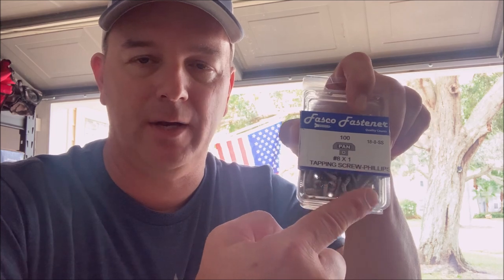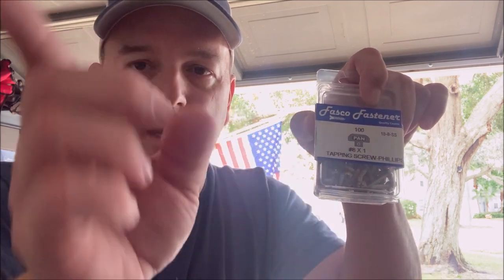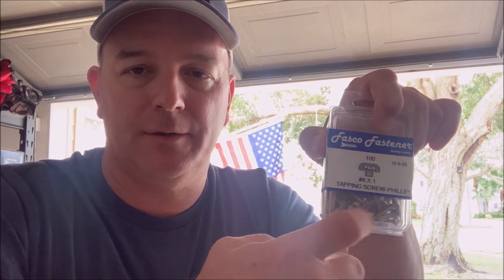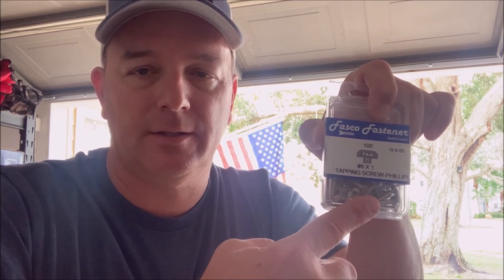Make sure you use good stainless steel screws for your installation — not wood screws or drywall screws. These are self-tapping, but make sure you drill a pilot hole first when going into fiberglass, because I cracked a small piece on mine without one. Don't make the pilot hole too big or you'll strip it out and lose the bite. Good stainless steel self-tapping screws in the right size are what you want.